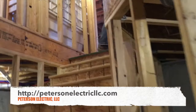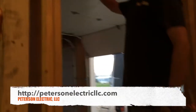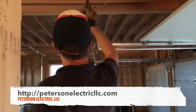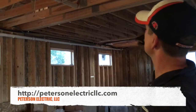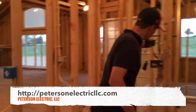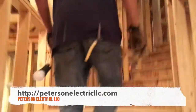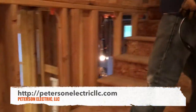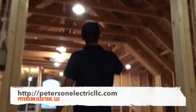I'll show you the office real quick — it's a nice little feature they put above the garage. Getting all that garage drilled out was difficult. We ran a 14-3 to the garage door plugs and a 14-2 over to control the lights for the four LED strip lights. Remember, on the back side of each man door you've got to have a light and a switch. This four-way goes from here to there and down that hallway for the can lights. We went ahead and put an outlet in the stairway — you don't have to for code, but that stairway is fairly long for most vacuum cords.